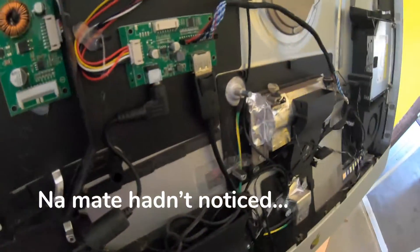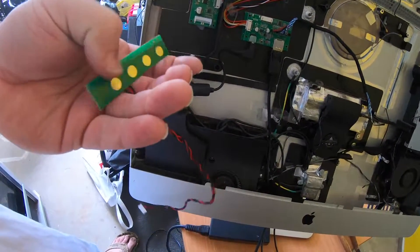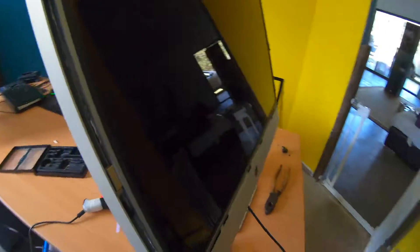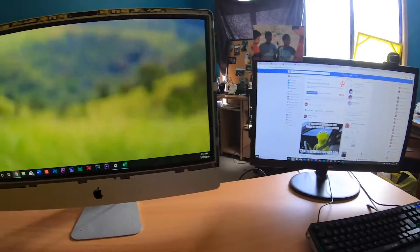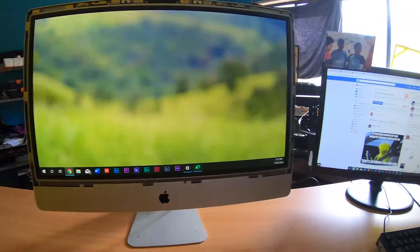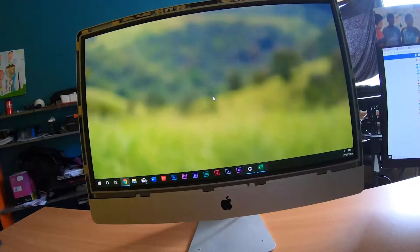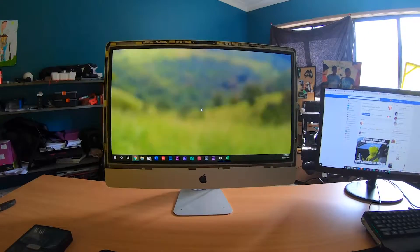I'm also going to secure this with hot glue onto the outside of the case so that I have access to the on/off button. The screen is put on. It's a bit of a mess back there, but I had to make sure the hot glue made enough space to prevent the bottom part of the chip making contact with the aluminum frame. And after all that, the moment of truth — it works. A little bigger than what I'd like, so I'll have to change the settings, but that's it. I'll put the links to what I used in the description below.